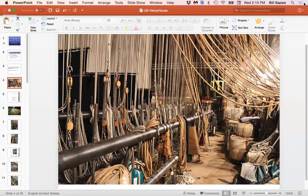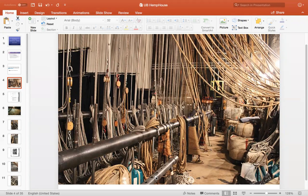Would you define tailing for the crew? You would bring your working line, whether it's the block and fall working line or the piece of Dacron, down to the lower rail that you see in the picture here. And we would use a snatch block, which is a block that you can open and lay the line inside of and then close the block. The person who would be out of the way, usually upstage from where you were, was pulling on that line while the capstan winch was working. So they were taking care of the loose end of the rope to make sure that it stayed orderly, and they could also assist in the lift. If it was a straight 1-1 lift, like with a block and fall, they could assist with the lift but not be in the way, and they would tail that line.